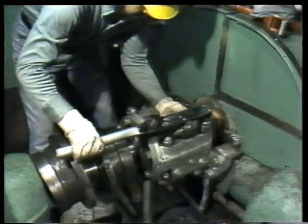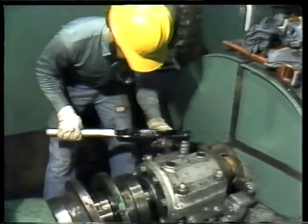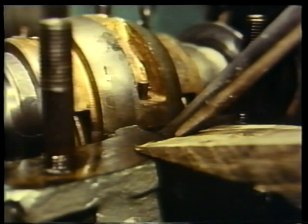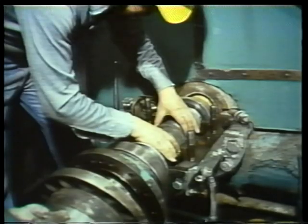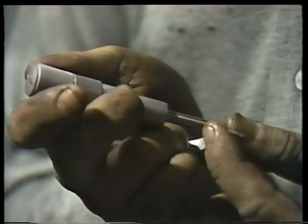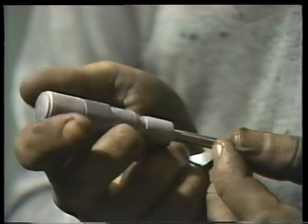Once the housing is torqued down tight and the leads are smashed as flat as they're going to get, start removing everything again: unscrew the nuts, lift off the housing, pry out the pins, and lift off the upper shell. Now remove the two upper bearing inserts and measure the leads with a micrometer. Check them in several places along their length — you're looking for the largest reading on the flattened part of the lead. High spots will show up as slightly smaller readings, but we'll take care of them after the bluing test.